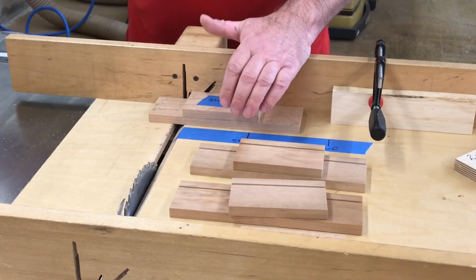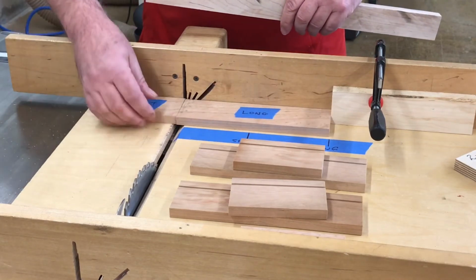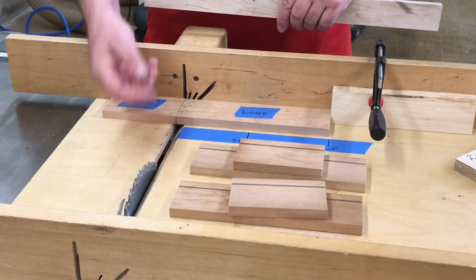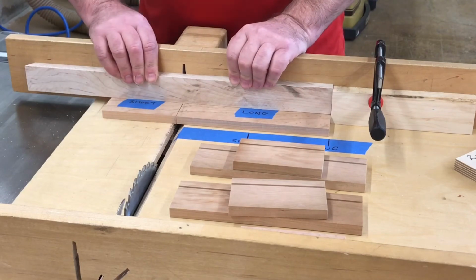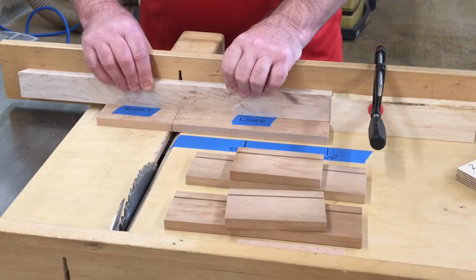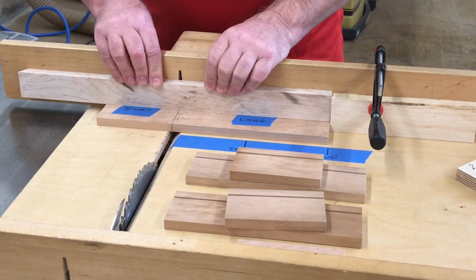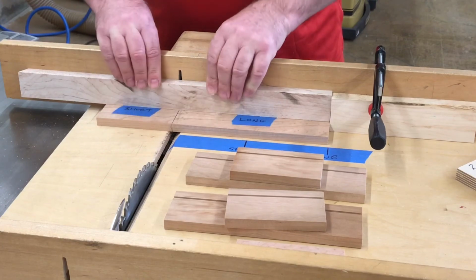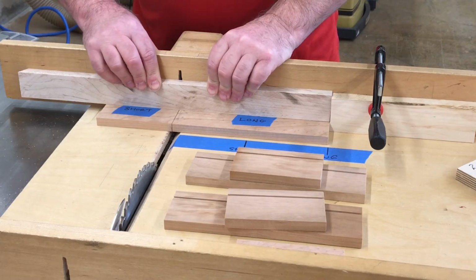It's very simple, but we're going to throw in an extra tip here, which is that when you're doing this, or anything on the table saw, when the parts might wiggle around and get caught by the saw, you can actually put a secondary thing right up on top here and hold it down while you do a cut. And so it holds these two pieces during the cut, but look, it also keeps your hands way up here, so I don't have to do this, I can do this. So there's no conceivable way in which the blade can touch my fingers. That's it for the second tip.